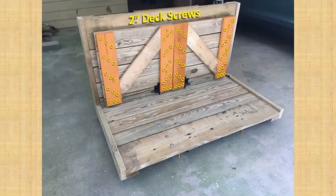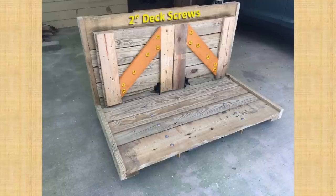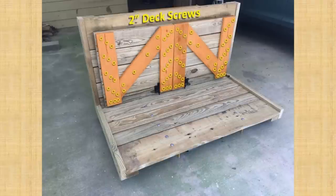I recommend putting the rest of the screws in with the side panels open and an eighth-of-an-inch shim between the bottom of the side panel and the platform bottom boards to make sure there's clearance when you open them. After the other screws were added to the vertical deck boards, I decided to add diagonal boards for extra rigidity since I had the material on hand. Here's the screw pattern for the diagonals, and here's the combined screw pattern.